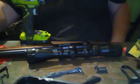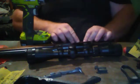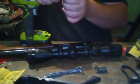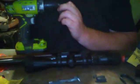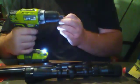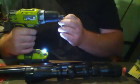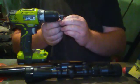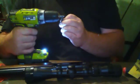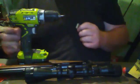Okay. Give me my 1000 grit. Gonna fold it in half. Fold it one more time, just to make a nice sturdy little thin strip. And I'm gonna get it up and over. See if I can maybe adjust this so you can see it. There we go, that's good. Alright, so just like that. Not touching the thread. Moving it back and forth. Every now and then I'll adjust my paper so we're not on a worn piece. Okay, that should be good enough.